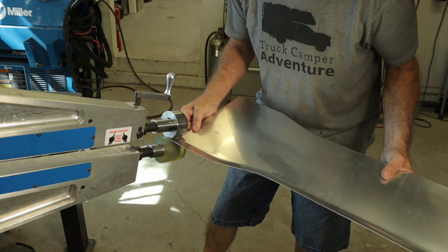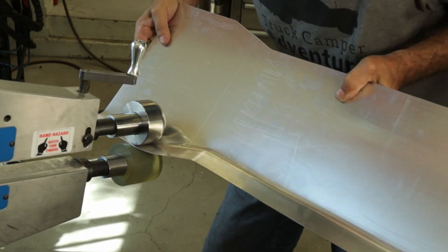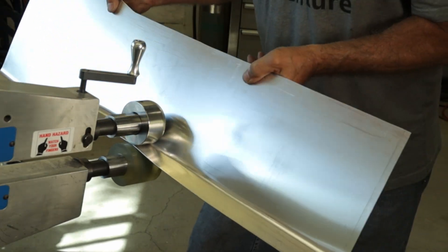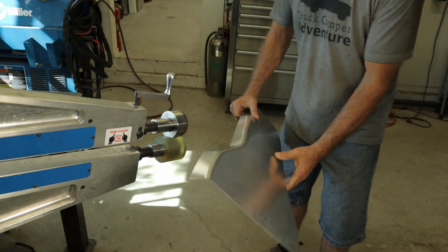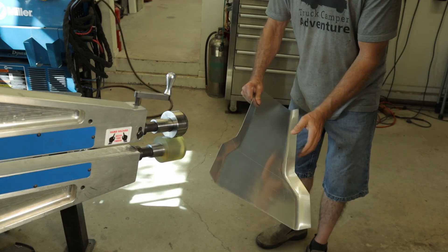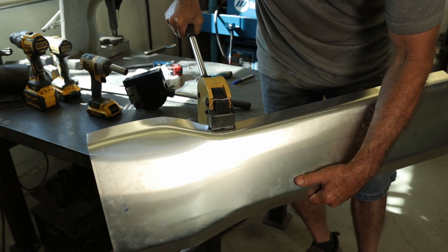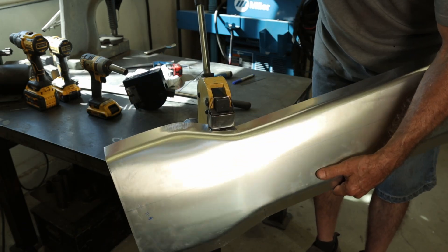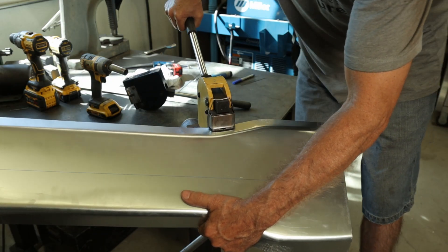The console has to change widths a couple times, and since I wanted a radius on the edges, I thought I might be able to just tip roll the edges, contours and all. Doing this made the top no longer flat — it's got to be flat. So out comes the shrinker stretcher to try to bring back the flat top. The tool did a great job of further destroying the piece with teeth marks. It also split the metal.